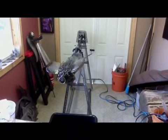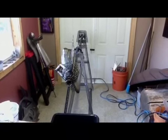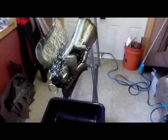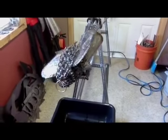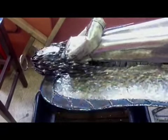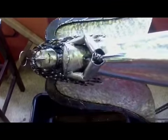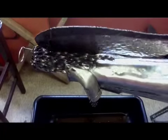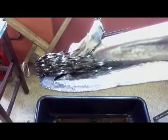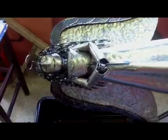Here's my first angel that I clear coated on it. I literally just pour the urethane over and then turn it, let it drain, turn it, let it drain, and then just let it run. I go in the house and come back the next morning and it's really nice — it really works well. There's no way you could clear coat the hair like that by spray painting it. These pieces really need penetration of clear in every little nook and cranny if you want them to last the best that they can.